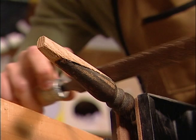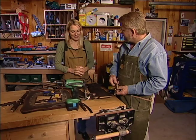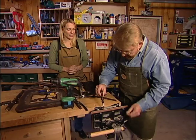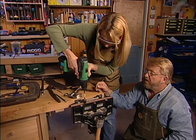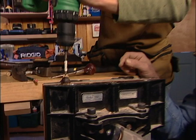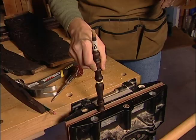Well, this is the other repair job we've got to do. We were kind of rough on this chair. There may have been some cracks here and we just, in tugging on it, caused them to get worse. To repair this spindle, which is broken in the middle, we'll first drill holes into the broken ends, apply some glue, insert a dowel, then press the broken ends back together. You'd never know.